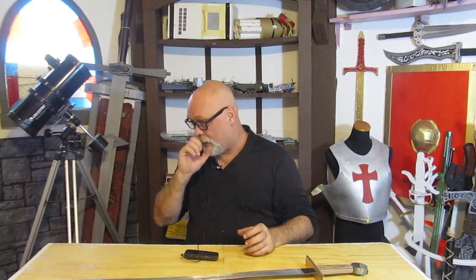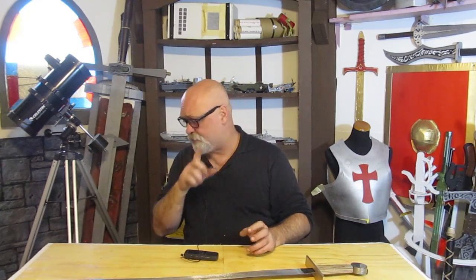So there is a range where the amount of carbon in the steel is about right. That range is typically around 0.6% — so less than 1%, somewhere between 0.5 and 0.7%. That will vary depending on other things like whether there's any chromium or vanadium or other elements added into the steel, and how it was hardened and tempered.